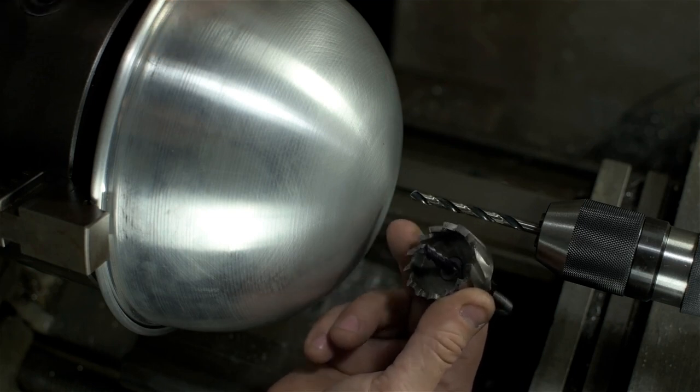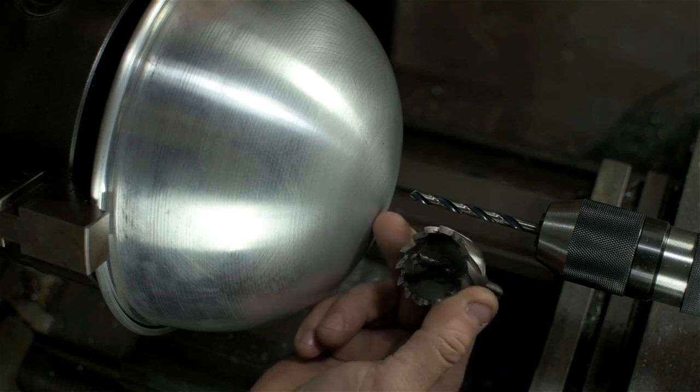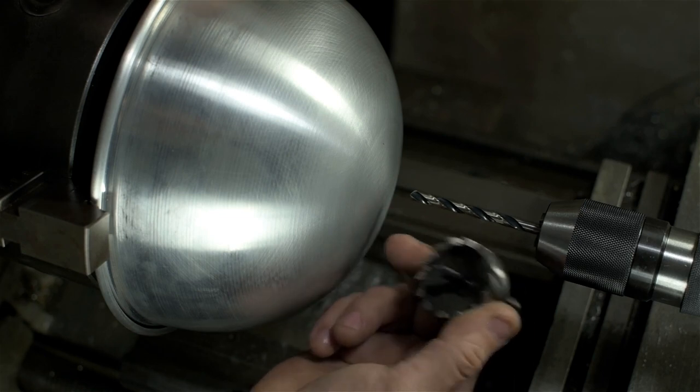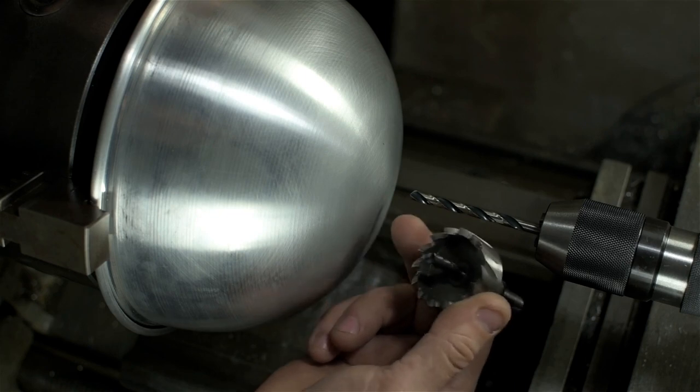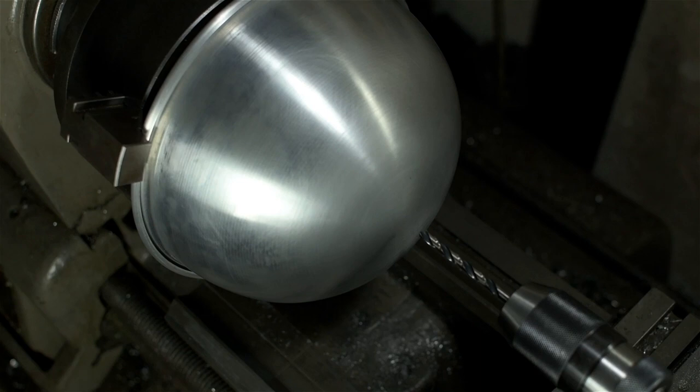The smart thing to do would probably be to put this on the mill with toe clamps all around the rolled flange and hole saw it from the top. And I just know if I would have just gone ahead and drilled this, it would have worked fine, but because I'm making a big stink of it, my odds of things going south have just gone north.